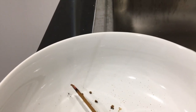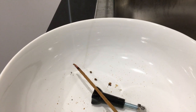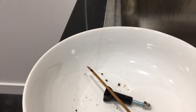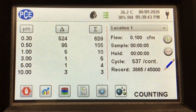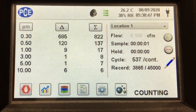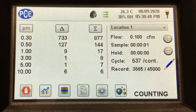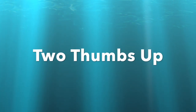In our third test we burned some incense — you can see it burning here — we burned it for about two minutes and were able to produce about 611,000 particles per liter in the 0.3 micron channel. This is the data from the particle counter at the end of our test, around 3 hours and 15 minutes, and we got the particle count under 1,000 particles. Basically in 3 hours and 15 minutes we were able to reduce the particle count by 99.9%.